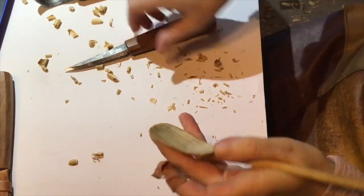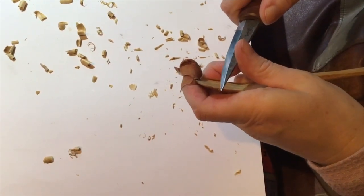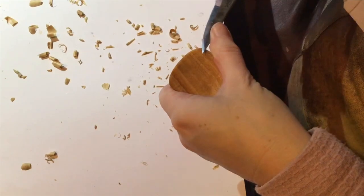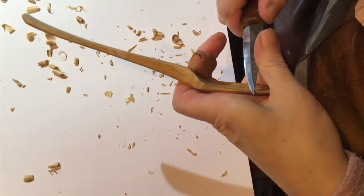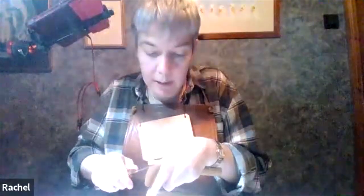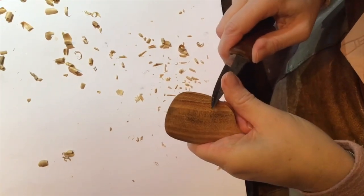And then I'm going to burnish it. And that's effectively going to take off the sharp corner as well. So then I take a chamfer around the edge of the top surface, and again, taking as little as possible. And then off the back, right the way around the perimeter. I always try and start in the same place so I remember. Because of where the grain changes, I start halfway down one side and then I just need to remember to go all the way around and then start there again.